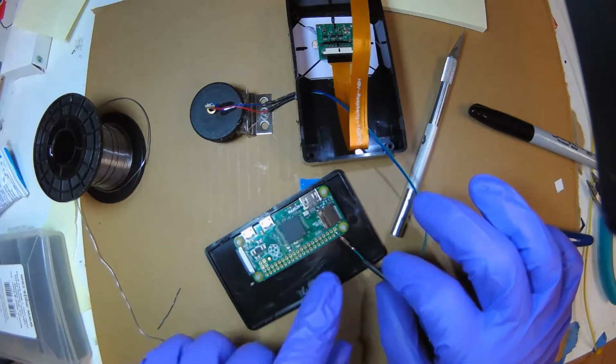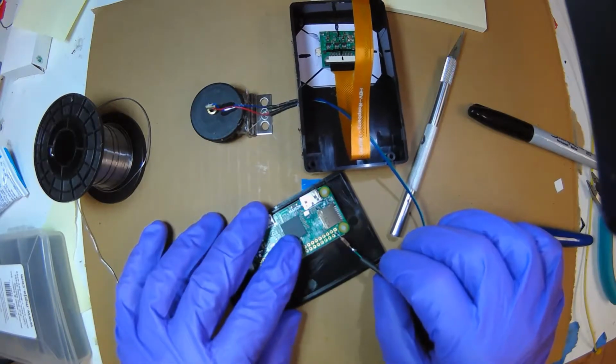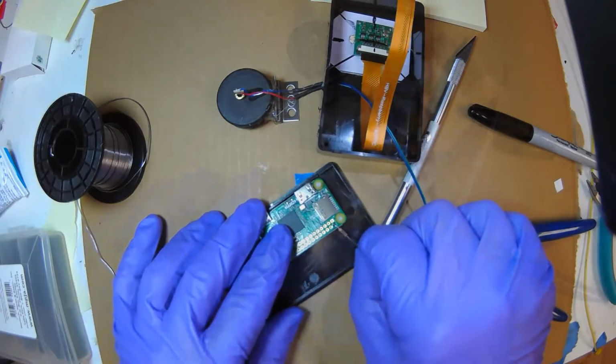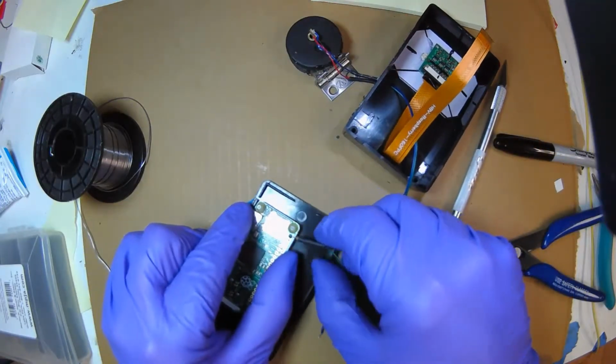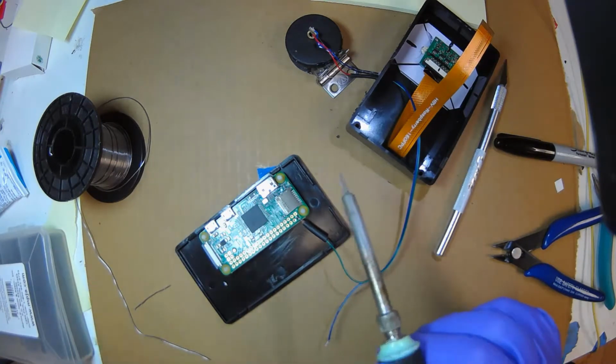Don't put the shrink on it yet, because the shrink will start shrinking due to the hot joint. When it's cold enough, you want to slip it past the joint and onto the resistor. And now slide it over. Ooh, beautiful. There it is. That's what you want. Okay, I'm going to clean my iron because I don't want lead all over this.